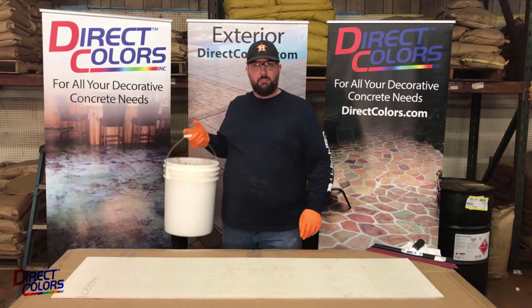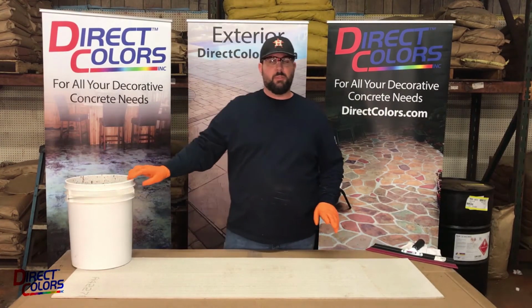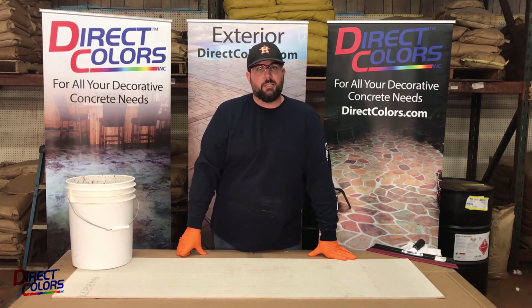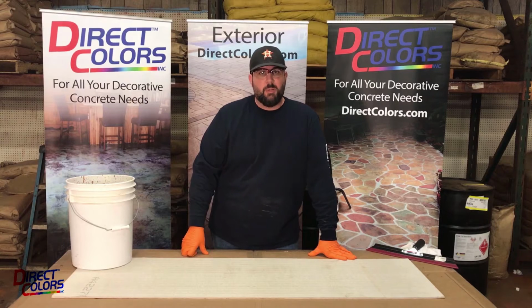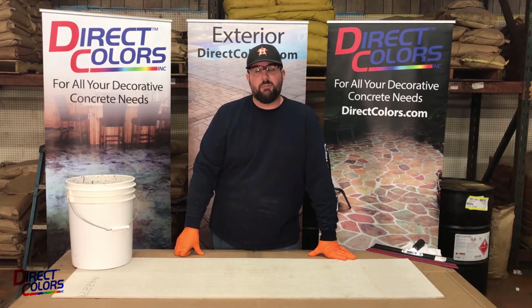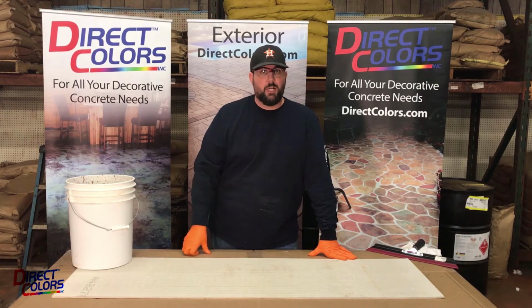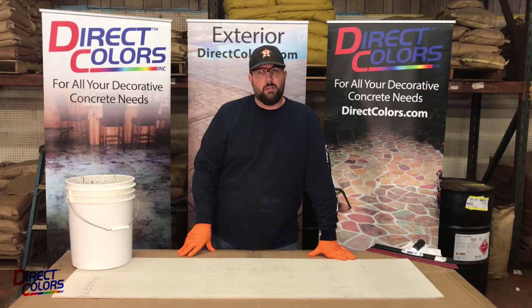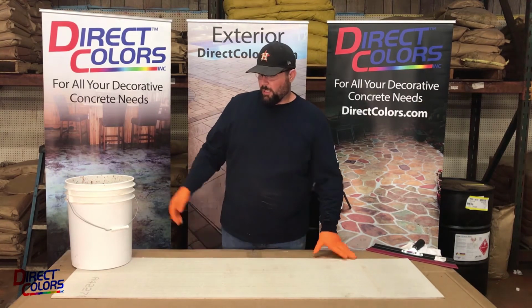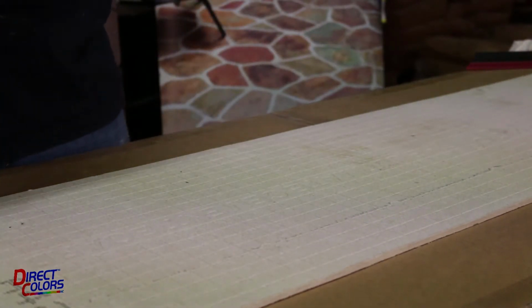Okay, so we've got everything mixed up. You've seen what that looks like. It's pretty straightforward and simple. Like we said, it is just an add water product, and that's really all we've done. Some overlays might require a copolymer to go down before you apply the overlay. This one does not. As long as your surface is profiled, like we've already talked about, you could just put this straight down on your existing concrete. It is dry polymer fortified. It's very sticky.